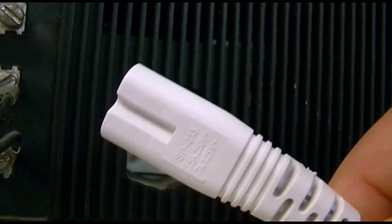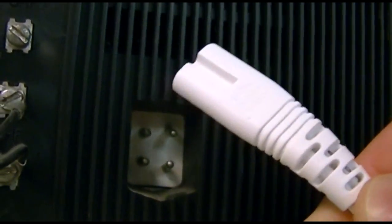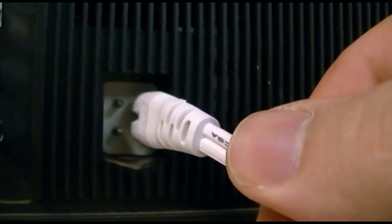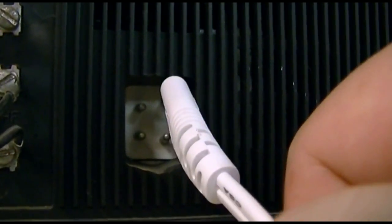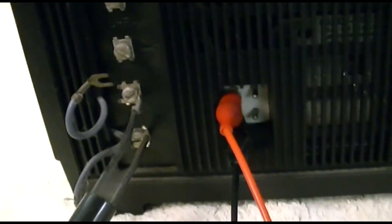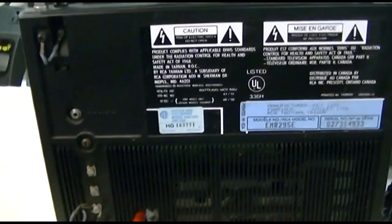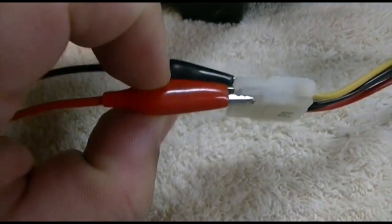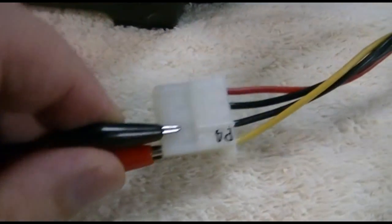You'll probably have to squeeze it on there. This plug, by the way, is from an oldie Kitchen Living gravy boat warmer — it was just convenient. This does fit right on what I believe to be the 12-volt pins without any problem, and I have a sneaking suspicion I had bent those because that's where I believed the 120V to go. So I'm actually going to try and power this thing up off of the 12 volts using a PC power supply and we'll see if I'm successful. I'm only guessing that the top is positive and the bottom is negative — I have no idea, I could have it backwards. The alligator clips are on either side of the Molex connector, hooked to black and yellow for 12 volts. This supply seems to put out about 11-point-something volts, with the 4th pin jumped to ground using a ground wire out of a piece of Romex, just taped up so it doesn't hurt anything.